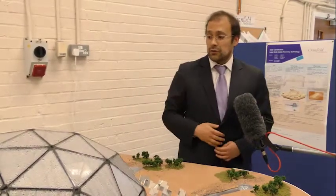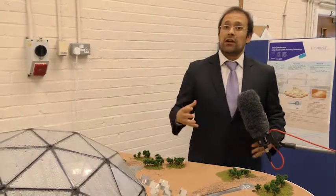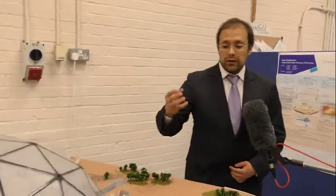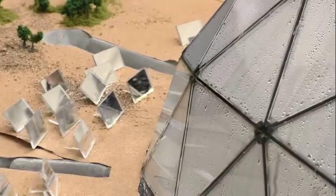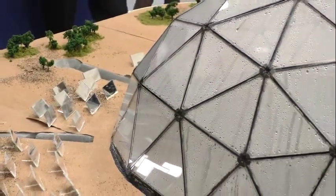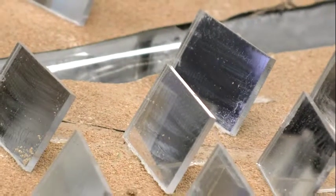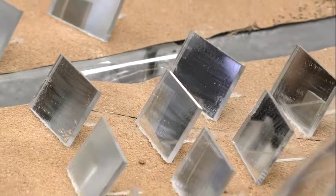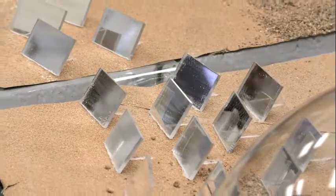This is how our proof of concept is working. Obviously at large scale we need much more water — we're talking about around 800 watts per square metre. We also think about how we can improve this further. So we are using mirrors all around the dome, basically to focus more energy into the dome to heat more water. For the full scale, we're talking about recovering up to 2.4 megawatts more, which helps increase the efficiency of the plant and increases productivity overall.